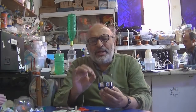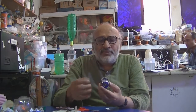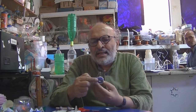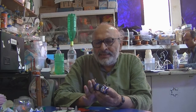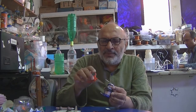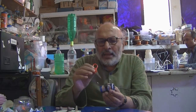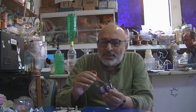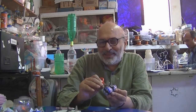Now this is a very simple electric motor. The most expensive thing is a torch battery, which is 1.5 volts. Once again, a cycle tube keeps two safety pins in contact with the plus and the minus of the battery. This is a magnet, a small ferrite magnet, a weak magnet, and you can put it with a rubber band. Because the body is made from mild steel, the magnet will anyway stick. This is more like a stepney. If sometimes this breaks, you can use this. That's the purpose of it.